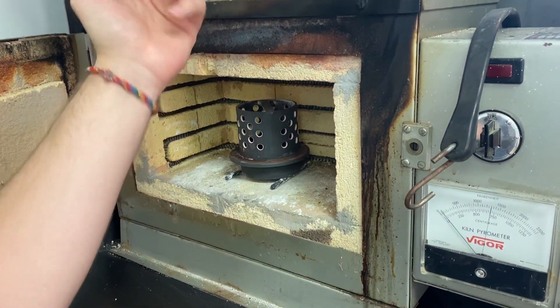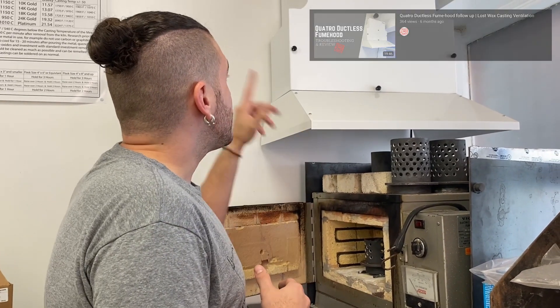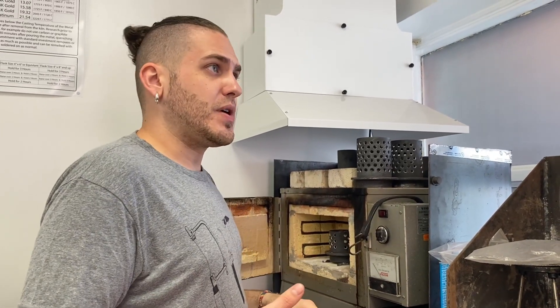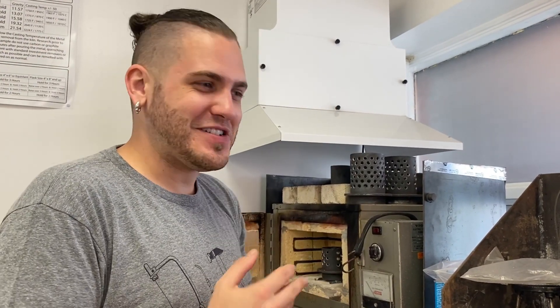Most of it will actually burn away and go up into the more important part of the casting process, which is the ventilation. We've reviewed this product already — take a look at that video because we did go into some depth with it. But this is a Quattro Air ductless fume hood. I know Arby also makes one, which is actually a little bit cheaper. However, when it comes to air quality, Quattro is definitely the name of the game — they are HEPA everything, they are medical grade, it's really good stuff. The point is when you're doing a burnout cycle, it's good to have ventilation because there's quite a bit of smoke that comes up and it needs to be treated properly. If you're in an urban environment such as us, here downtown Peterborough, you don't want to be just kicking fumes off into the night whenever you're doing your burnout because you will undoubtedly get complaints. So this was our solution. If you're just doing this at home, definitely consider your neighbors — someone might freak out thinking there's a fire.